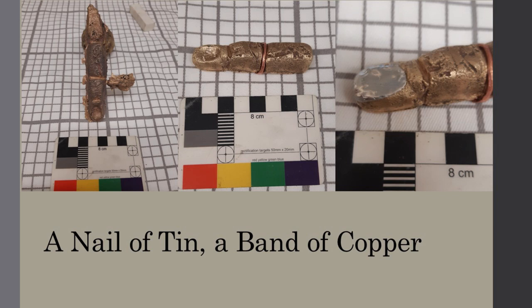The fingernail bed was made with a depression so that tin could be poured into it, simulating the silver nail found on the Acropolis. The depression was drilled into after casting to give the tin more surface area to adhere to, and as tin has a very low melting point, a leftover lump from the casting sessions was melted on a hot plate and carefully poured into the depression. After about five attempts, it finally pooled in the center of the nail bed and adhered. The edges were then cleaned with a file to make them flush with the edge of the nail bed, and by constantly handling the finger, the oils on my skin cleaned the surface and revealed the golden yellow color of the bronze. The final result was an object that displayed exactly what I was looking for — I could tie it back to archaeological sources and it revealed the colors possible simply with the addition of metallic features rather than any form of paint or patination.